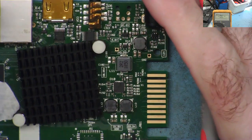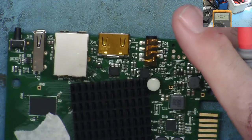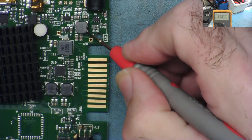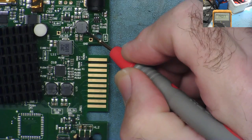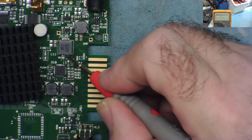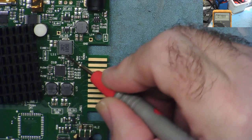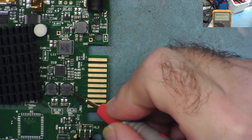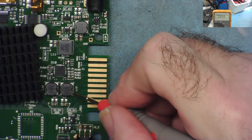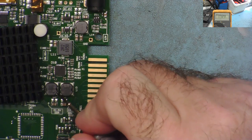This low resistance we read, let's have a look to see if that actually matches the resistance from any of the coils to ground. So I'll get onto ground. So this is reading 14. It's just changed a bit because the capacitor's charging, but 13k. This one's reading about 20 ohms. Effectively, that's like the V core. This one is reading, it's dropping, but it's in the kilo ohms range, 6.5 kilo ohms. And this one is reading 1.7 kilo ohms.